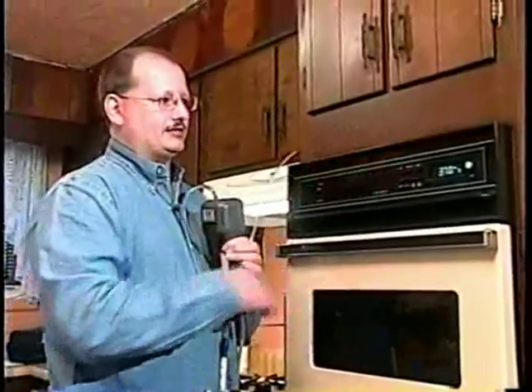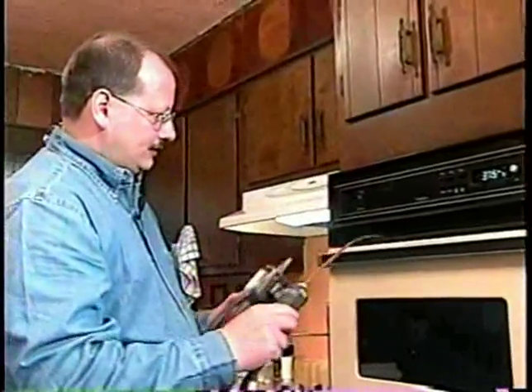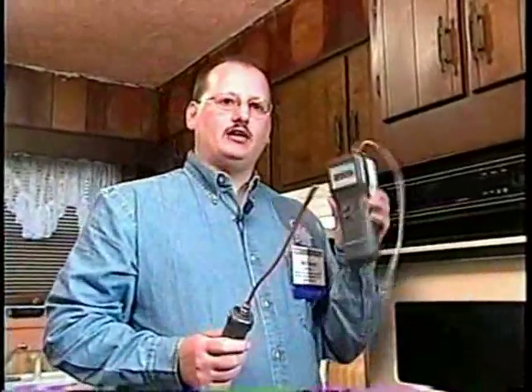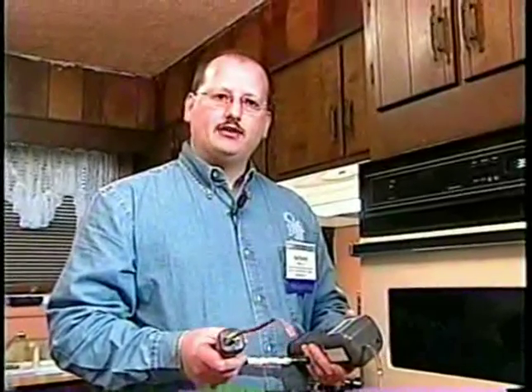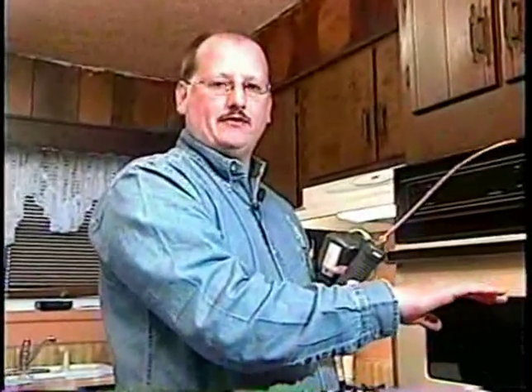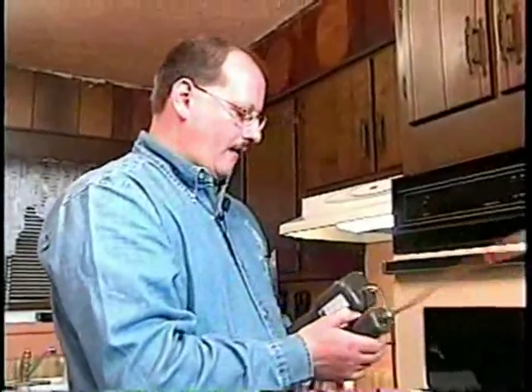Now on the oven — the oven's up to 370 degrees. Some folks will only go to 350; there are different protocols. I tend to go to 500 on my setting, that way it keeps the burner on for a longer period of time without cycling on and off. The vent for this oven is actually right in here. A basic CO meter only gives you a reading for carbon monoxide as-measured. If you use a combustion analyzer, it will also measure the oxygen and give you a measurement called air-free, which is basically how much carbon monoxide would be in the gases if you eliminated the oxygen. Because sometimes one oven might have 12% oxygen and another 16%, so it puts them on a level playing field.